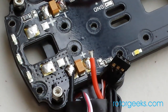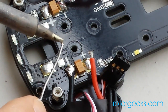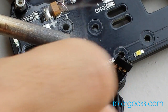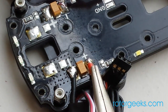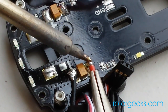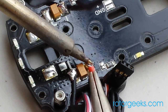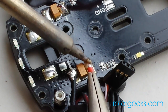Once again, just with a closer view — you always want to have some solder on the end of your tip, as that helps the heat transfer. If you ever find it's taking too long for things to heat up, chances are you don't have enough on the tip. Get a nice little bit going there, then bring it down. Give it the time it needs to heat up, and once it does, it'll flow nicely — there you go, you saw it just pool there.